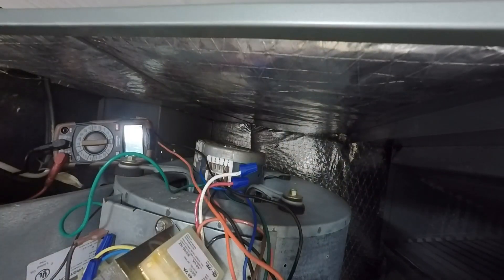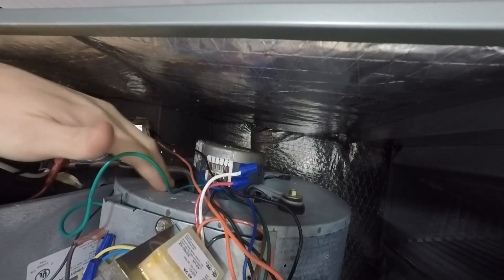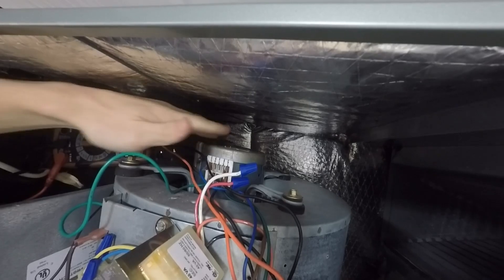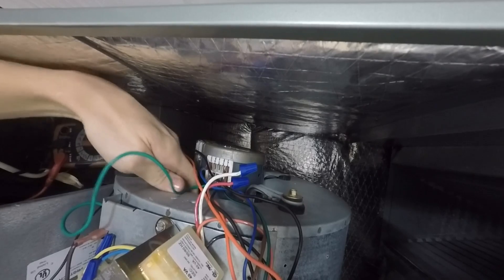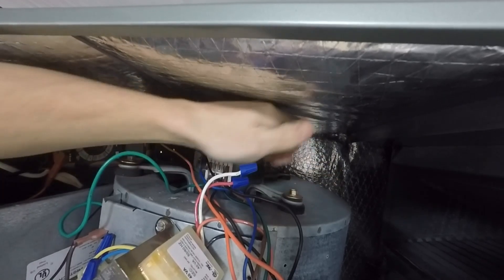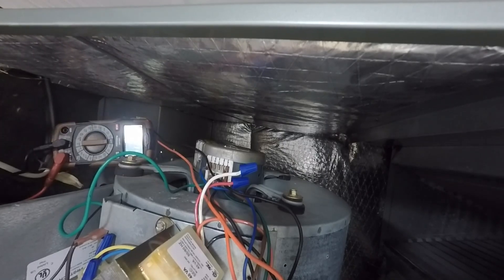Come in here. You want to remove your side panel and locate your squirrel cage fan, which is right here. This is where your electric motor is going to be with your module on top. The first thing you want to do, after you've made sure all electricity is off, is check to see if your motor rotates. Just go in here and feel your squirrel cage — see if it rotates. If it does, that's step one: the actual electric motor portion is functional. We know it's not seized.